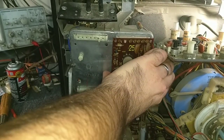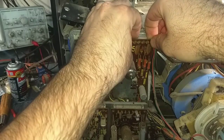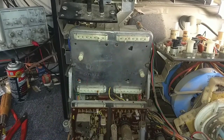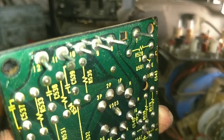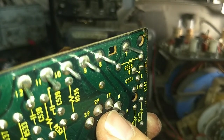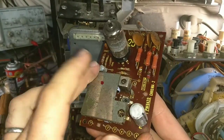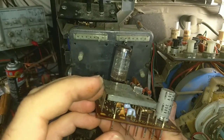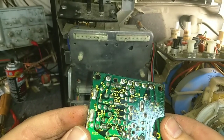That retainer just cracked — this is 50-year-old plastic. Alright, there's Chroma 2. That one's really bad too. That connection right there is almost completely gone, and this heater connection over here is pretty bad. The cathode connection needs to be re-soldered for sure. Then we'll check these electrolytics — there are a couple of chokes, an adjustment, and all those little ceramic capacitors underneath the shield, so there's obviously some sensitivity there they wanted to take care of.